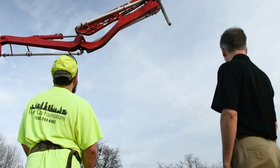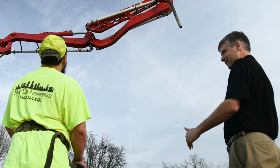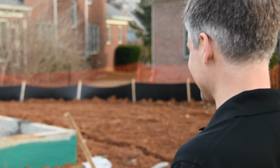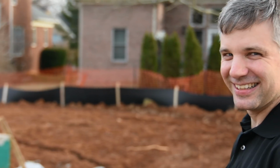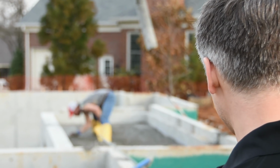When we backfill, we always take 2 additional preventative steps to give our houses a great final product. One, we always use Rubberwall. We're big fans of Rubberwall. It's a waterproofing system that protects the basement. It's a green rubberized spray-on product, and it comes with a lifetime warranty. So unlike a lot of products which are asphalt based, clients with Rubberwall have the option of, if they ever have an issue, they can call and it's taken care of, no questions asked.